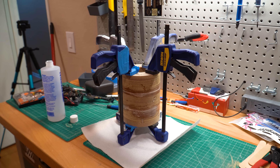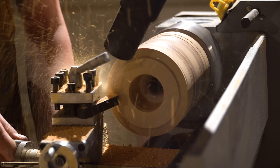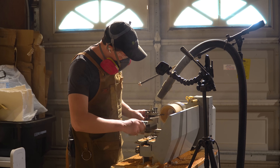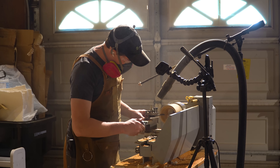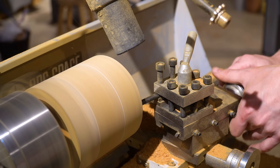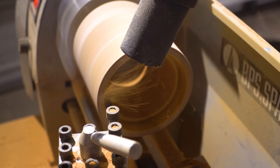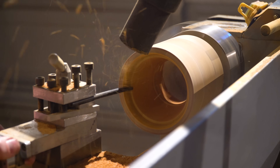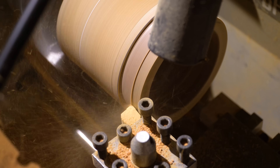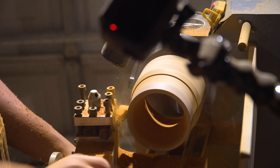After letting the parts cure with a ton of clamping force over about 48 hours, I tossed it on the lathe in the garage and started turning the outside diameters. Phenolic dust, much like graphite dust, is very not good to breathe in, so with basically all of this stuff I'm always wearing a respirator and safety goggles, and sometimes headphones too, because the noise of the lathe plus the shop vac gets pretty old. I'm still using that wimpy boring bar — a beefier one was ordered but hadn't arrived yet. Turning the inside tapers was a tricky process since all the angles are slightly different. After finishing the inside geometry, I went back to the outside to turn the taper to fit it inside the nozzle carrier. Then I moved on to the nozzle top insulator.